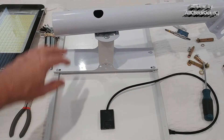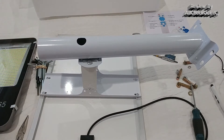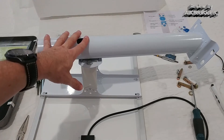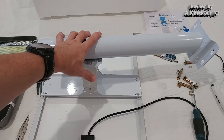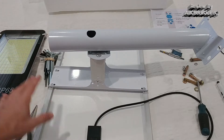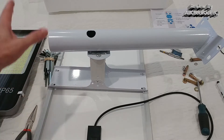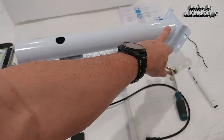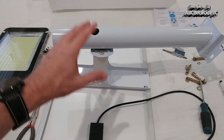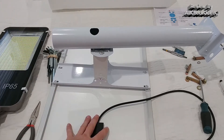This is the basic installation: rail to panel, bracket, and pole — keep everything a little bit loose so you can still adjust it. Now you have to decide whether to connect the pole with the light first. If you're doing the installation alone, I'd suggest starting with just this part, otherwise it will be very heavy. If you have a strong helping hand, you can connect the pole with the light and install the whole thing in one piece.